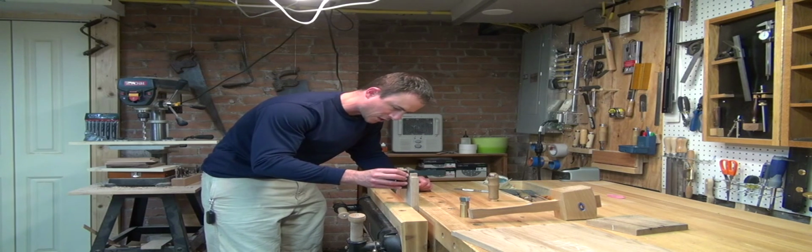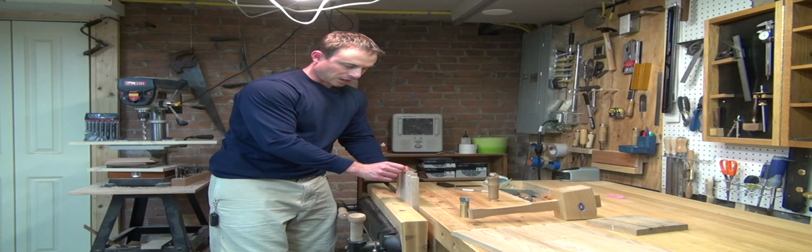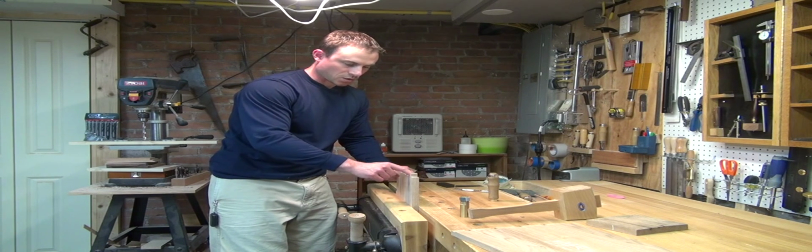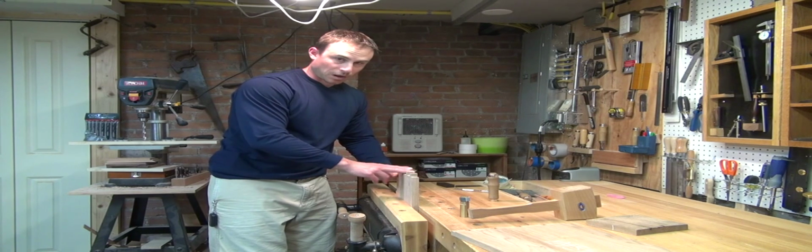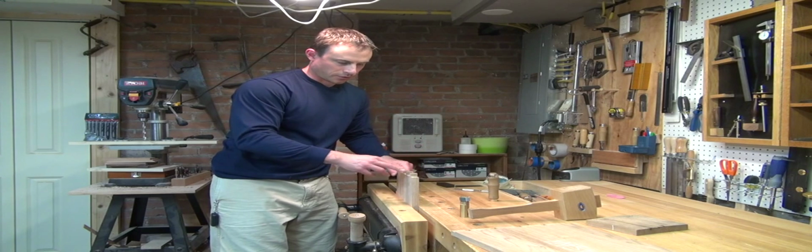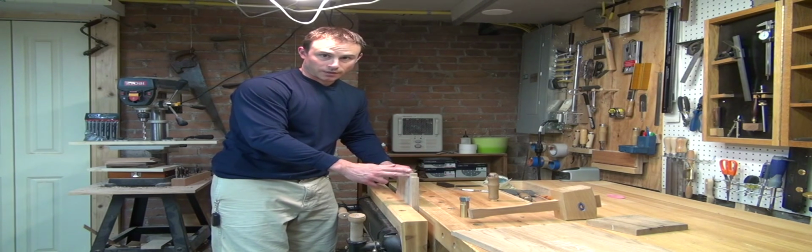So I've really just done all of my work looking for any gaps in where my lines were, making sure everything was nice and square, and making sure those corners are clean. And if you can do that, and if you marked your pins properly from your tails, or if you do the reverse, then you should have a pretty good success rate on the first fit.